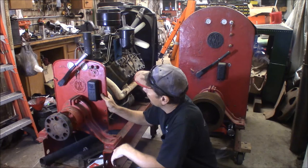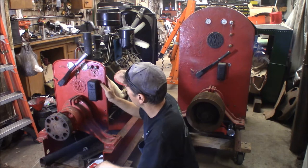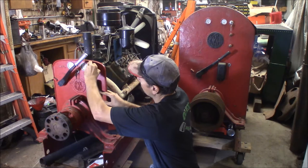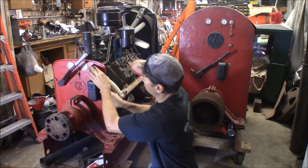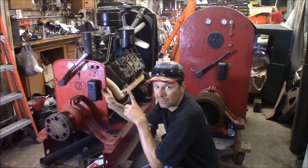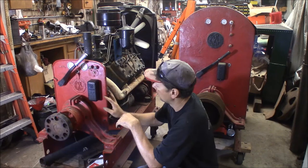Let me run around the back and show you the controls. On the back you've got a '37 Ford throttle and choke buttons, as well as a '37 Ford starter button. The Guardian here has a set of contacts — you hold this little piece down and it makes contact for the ignition. You pull your choke out, pull the throttle on a little bit, then hit the starter. When you release it, it holds the contacts in and checks for engine temperature and oil pressure. If it drops below 6 PSI oil pressure or the temperature goes over 195 degrees, the contacts jump out and kill the ignition — so this thing would be left running with nobody watching it, and it'll shut itself off if there's an issue.